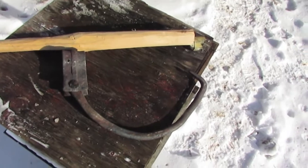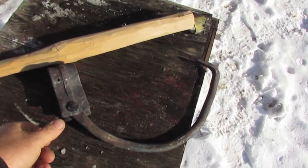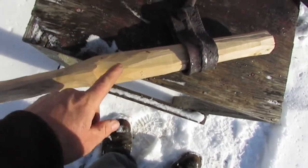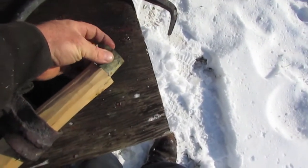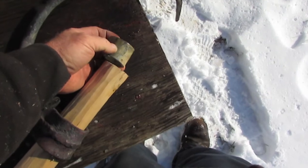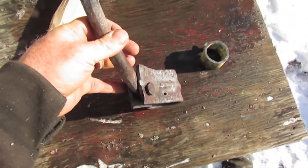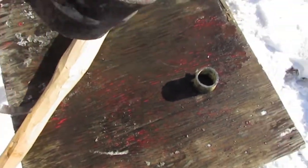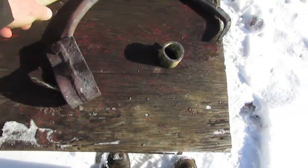Here are the components thus far, and I have to say, very, very happy. I've got to thin it down a little bit to get onto this. And then I've got quite a bit of work with this guy to fit that on. And then I'm probably going to drill some — a pin, or maybe just a nail — and then cold rivet that on. And there are some nice little holes from its previous incarnation, so I'm just going to use those to pin this to the handle.